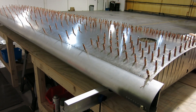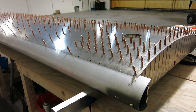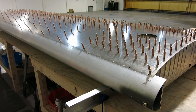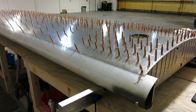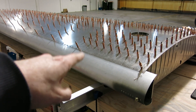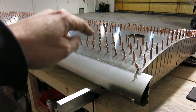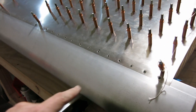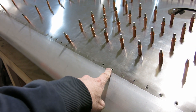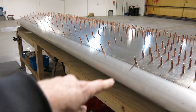I just wanted to say — Flying Cub, Glenstalker, and LT Voyager — you guys had a pretty good discussion about dimpling, countersinking, and final sizing for these rivets on the spar. I am super happy with how we did it. We went with the number 40 pilot countersink, the number 40 pilot dimple. We transfer drilled the number 40, did the dimple, did the countersink, and then final sized it to a number 30. Every single one of these CCC 42 stainless 42 flush rivets — all 103 in this leading edge — every single one of them was a perfect pull. And we wet riveted that.